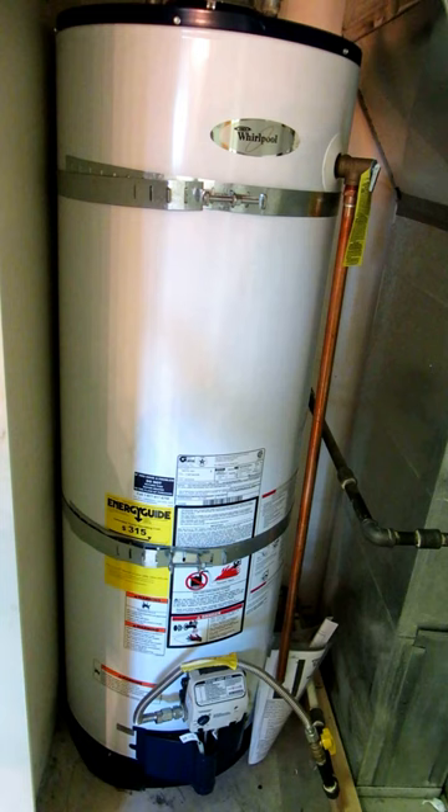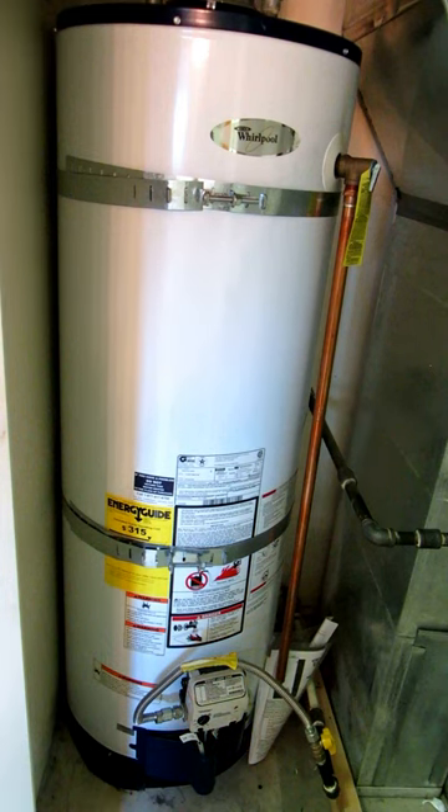It could break pipes and it could even tear electrical wiring. It could cause a fire, an explosion, or water damage from flooding from broken pipes. So if you do have a water heater and you live in earthquake country, you need to strap it to the wall.